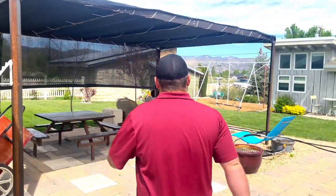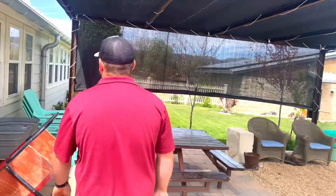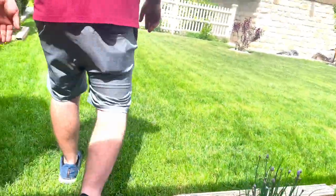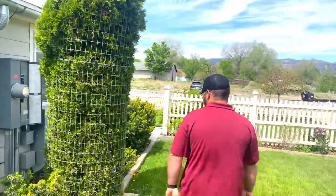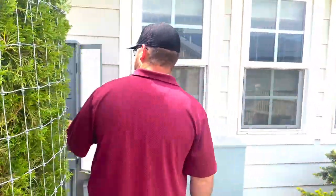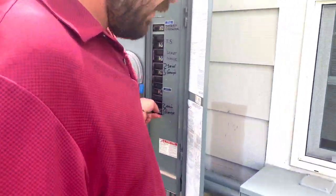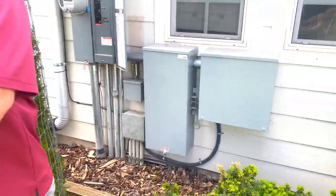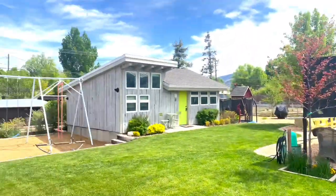Jake, what are you doing right now? I'm flipping off power to the battery unit to do a grid failure test — flipping off the main power that the grid is supplying to the house, to test whether the battery will automatically switch on so they'd be completely off-grid. The transfer switch clicks, and they are now officially off the grid.